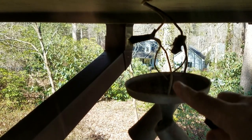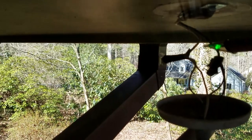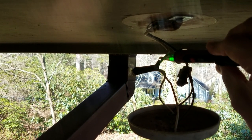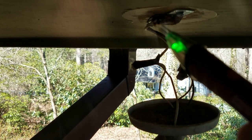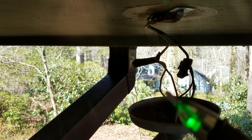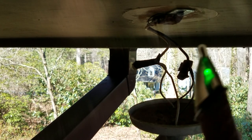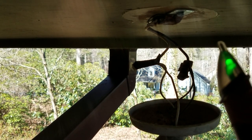As you can see, the fixture is dropped from the ceiling. Now I'm going to use my tester to see if we have any power. I have a fast flashing red light, which means there is voltage on the black cable. There are two switches that can operate this fixture, that's why there's a lead that's hot even though the switches are off — the voltage has to travel through to the other switch. This means I have to go to the fuse box and turn the power off to this circuit, which is always a smart thing to do anyway. I should have known better knowing it was a three-way switch.